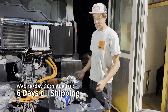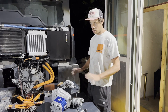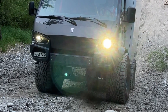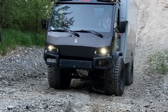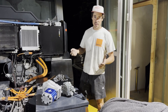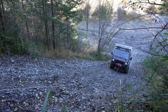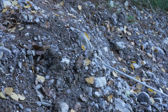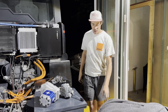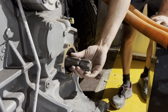We're in a huge stress because in six days the truck is going into the container and off to Chile. There is absolutely no space for any mistakes. We need a winch as a backup safety when driving up the hill, in case the vehicle starts sliding so it won't fall all the way down the mountain. The problem is that the winch needs to pull in the rope fast enough so we can drive while pulling in the rope. Our hydraulic pump on board is not delivering enough volume to drive the winch fast enough.